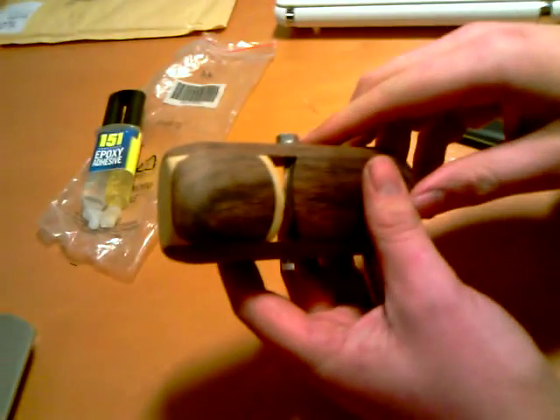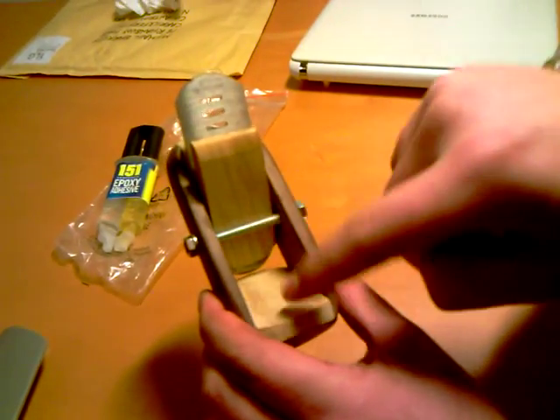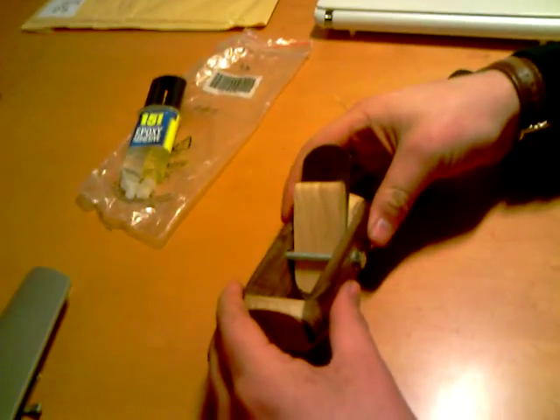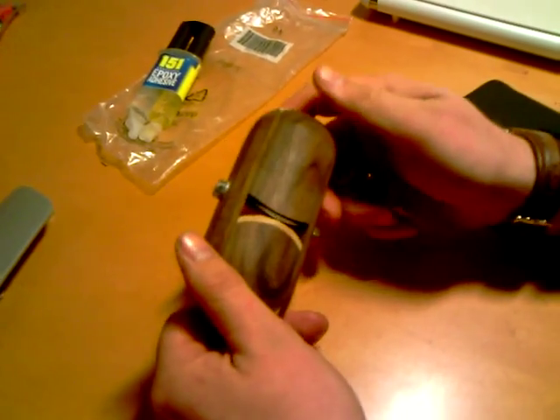When we're making these, the important thing is the gap between the blade and the opposing part. That makes sure the shavings come up into this area instead of going along the bottom, lifting the plane off the workpiece — it just becomes very messy and this will score.